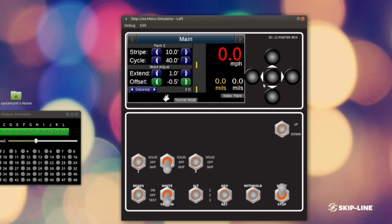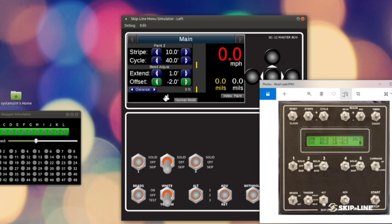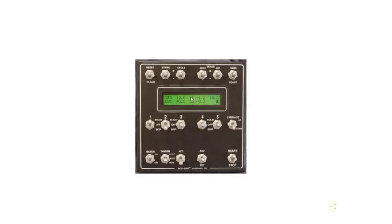Now, if you're going into the wind, that's going to cause additional wind resistance. You're going to want a larger negative offset. Now, notice how you can basically account for the wind variable with one setting, where on the SM5, there were two settings: bead lead and bead lag. A lot of people really got used to this control. However, this is limiting, because usually the length of the bead pattern doesn't necessarily change. What changes is where you want that bead pattern to fall.